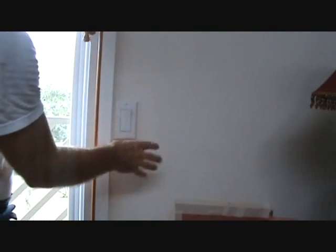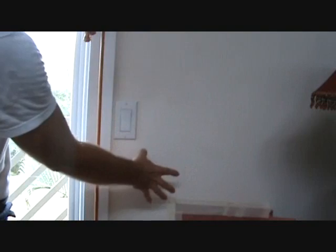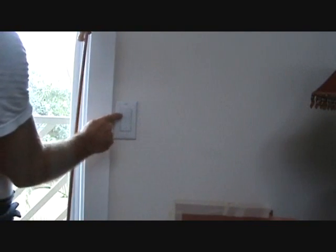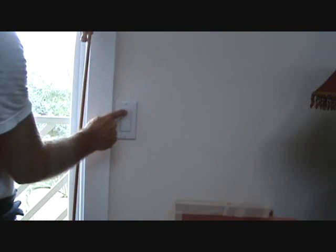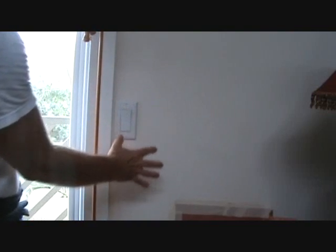That'll look way better than leaving this. I could leave this switch alone and add another light switch over here, but I really don't want to do that — then I've got two single switches on this wall. It would make it a lot easier, yes, but I want to make this look like it was existing conditions. I don't want someone to say, 'What'd you do over there? I see you added a light switch.' If I put the light switch over here, it's going to be trickier, but it's going to look way better — it's going to look existing. I'm going to put the same type of paddle light switch right here next to the existing one, and it's all going to look the same. Whenever you're working on your project, you always want to try to match existing conditions as best you can.